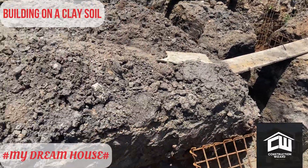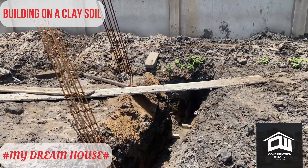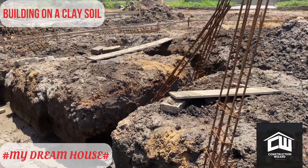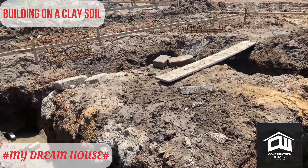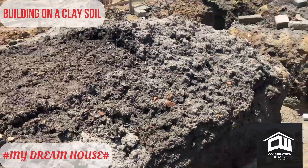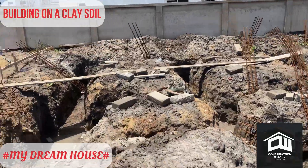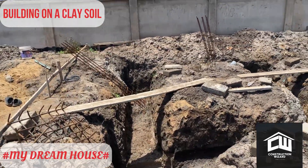After the trimming we did a filling of gravel and then compacted it. We placed one foot of gravel and did that because the soil was bad — to stabilize the foundation before the blinding. So we brought in imported gravel, filled to a height of one foot, and then compacted.